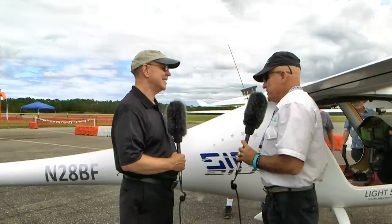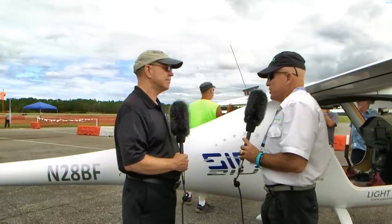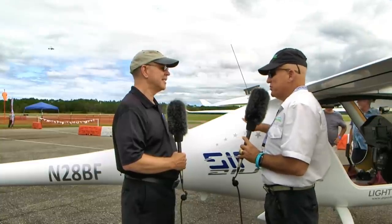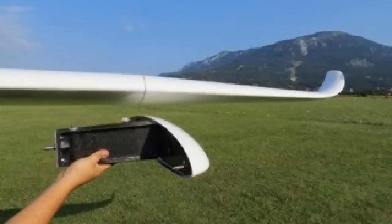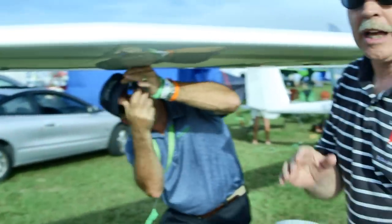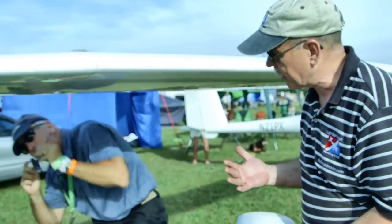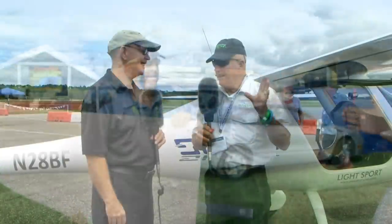In late 2011 I ordered my second demonstrator and said I've got to have one with removable wingtips — so they did it. We've probably sold 30 or 40 of them in the U.S. since then, and every single Sinus we've sold has had a removable wingtip. We call that the 'flex.' The outboard portion of the wing has a spring-loaded bolt that goes up into the wingtip spar. From the bottom, seven turns of a hex wrench tightens it down, and it comes off in about 30 seconds.